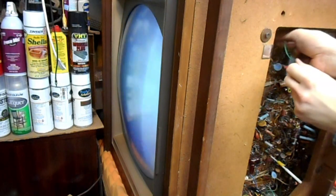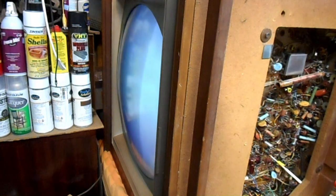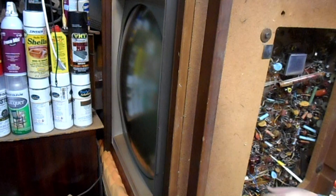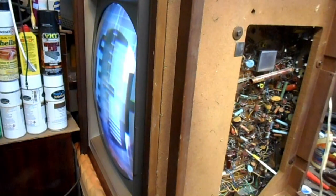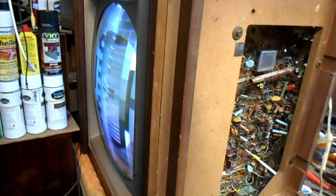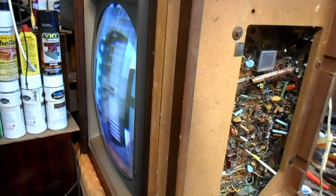So clearly the failure in this set is the tuner. That pisses me off slightly. Well, I guess now I test the tuner tubes before I go on to, almost sounded like the tuner briefly worked as the power was edging down, but I don't know. So the 6HA5 in the tuner was dead.